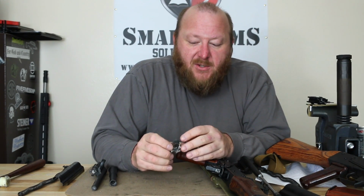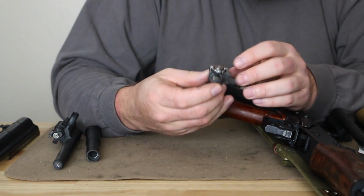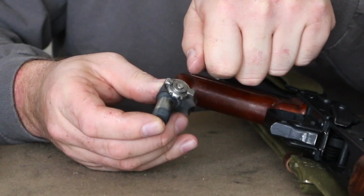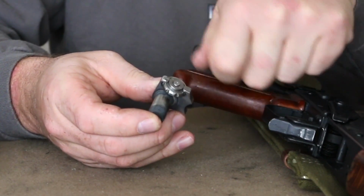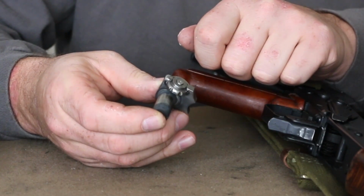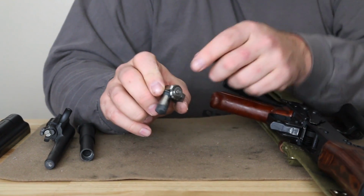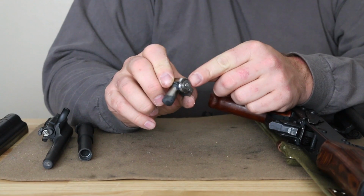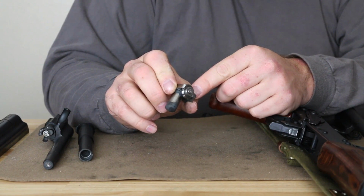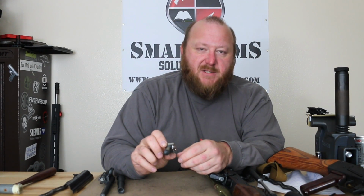As the rifle gets in use, you can see where you have the carbon that builds up. So that's one of the modifications that we're going to make, is a loop on here so you can stick in your cartridge tip so you can rotate the gas valve when you have carbon freeze conditions in it or you have a heat condition in it. It's a very, very simple system, and one of the biggest benefits that I liked about this particular design was this was on the outside, and it was relatively easy to get to dial. What we're going to show you right now is the procedure that you will take to adjust the gas system.